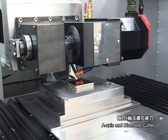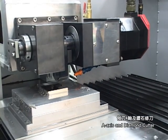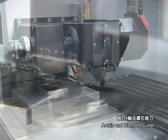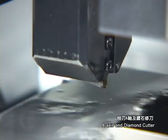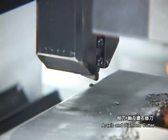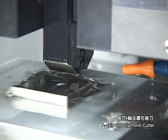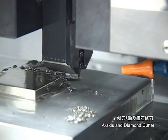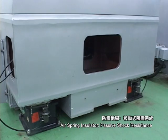For the A-axis and diamond cutter, diamond cutters are specially designed for groove cutting. Both an R-shaped and a V-shaped diamond cutter contribute to the high precision and high accuracy of the PV7000. The R-shaped diamond cutter is used for surfacing while the V-shaped diamond cutter is for precise straight grooving.